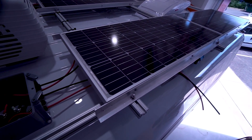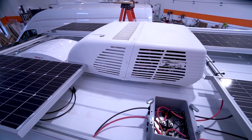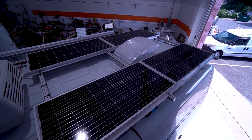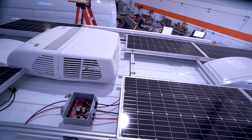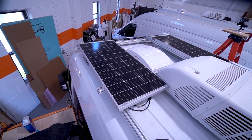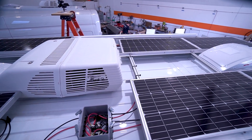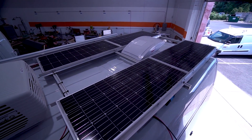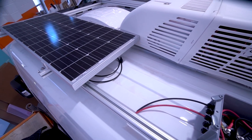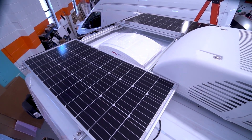The way these are wired, if we decide we want to go to series for higher voltage — though with less charging amps — we can do that. But I spoke with Victron directly and the MPPT controllers kick on when the solar voltage is five volts higher than the battery state-of-charge voltage. In the case of the lithium I'm using, that's about 7/8 of charge. So when the 630 amp-hour battery bank gets down to 7/8 state of charge the MPPT controllers kick on and charge until the difference is less than five volts. The battery wants amps, not volts, so with the parallel connection we get the most amps into the battery and charge quicker.